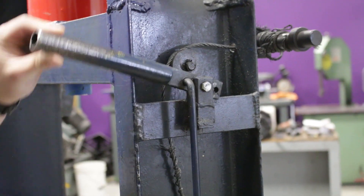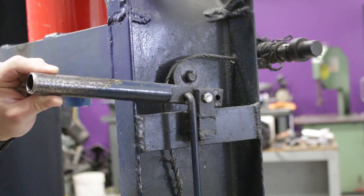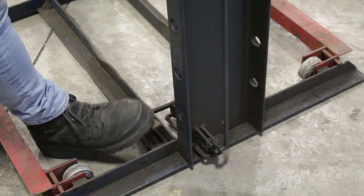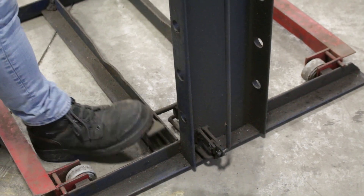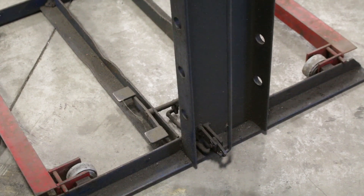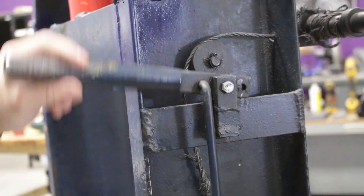I'm very sad about this one because we have to get rid of it to work with my setup here. But this is the handle that was connected to their spool valve which brought the cylinder up and down. What's cool is they attach it to this linkage and it goes through to a set of pedals, and that allows you to hands-free bring the cylinder up and down — super nice feature because usually using a press is like a weird three-hand job.